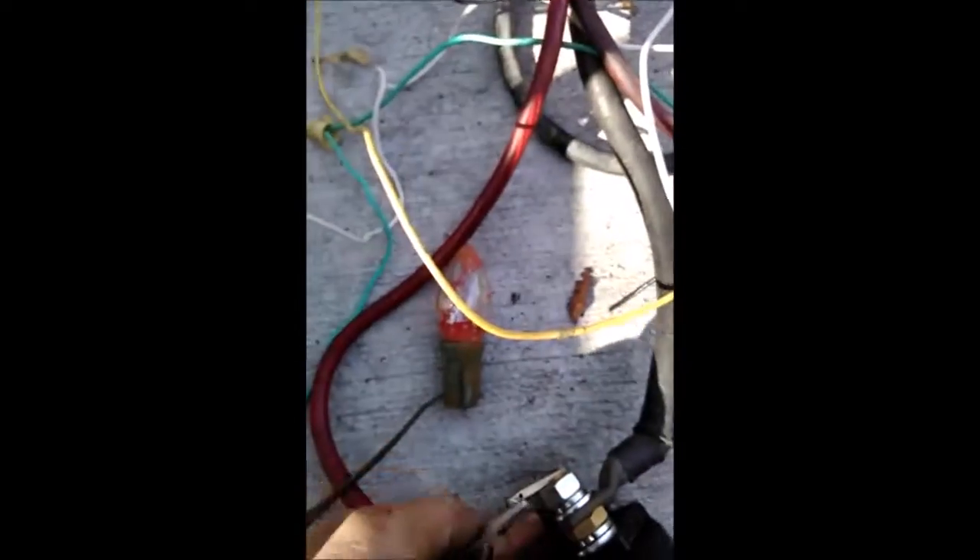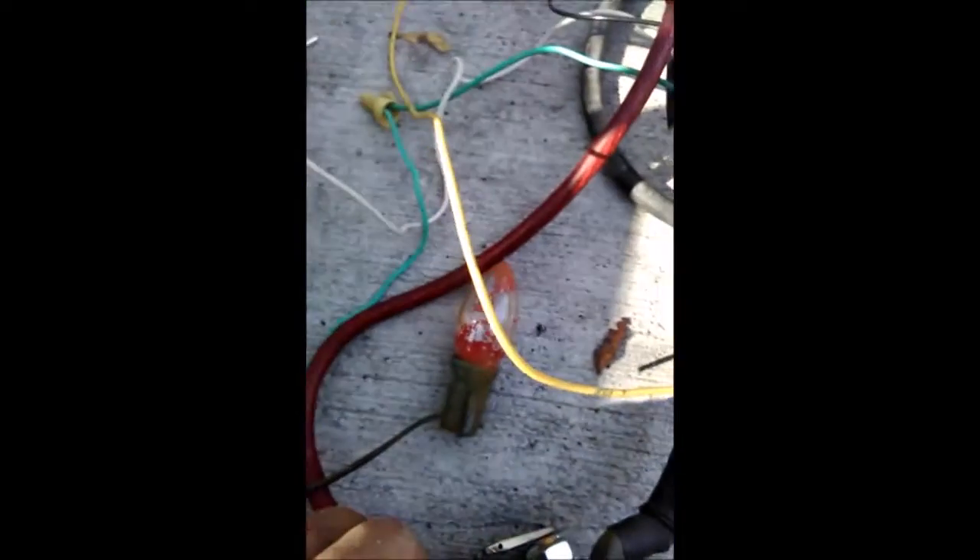I have a light bulb here as a pre-charge resistor — you can use whatever you want for pre-charging. You might want it always pre-charged, or you might want a switch for pre-charging so you won't run your batteries down. You'll notice when I hook up, the light bulb will light up a little.